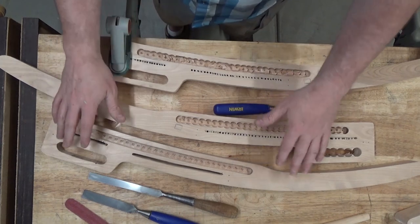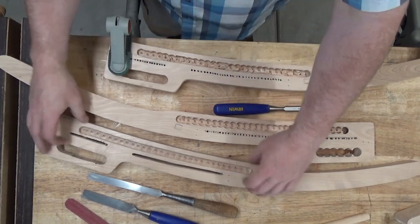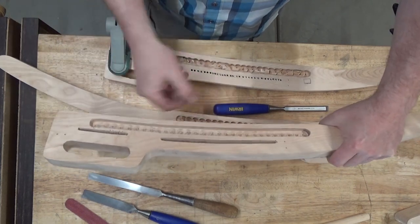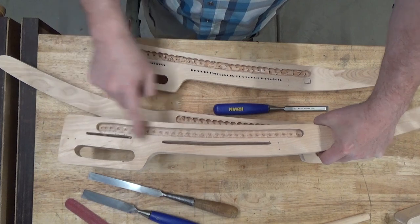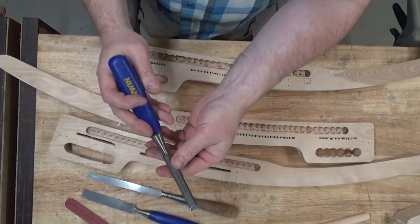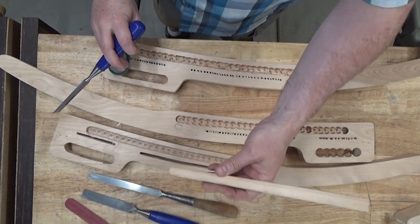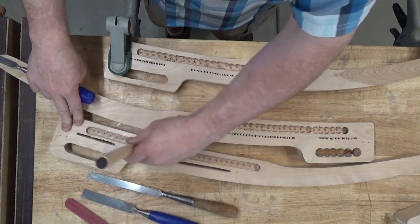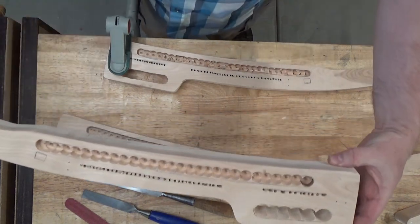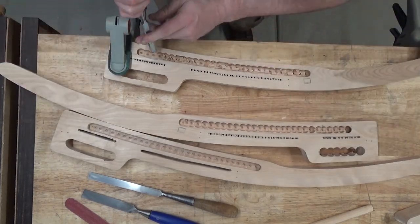I'm really close to getting the project back on track. Here you can see some examples of the work pieces at three different stages. This is that first terrible piece from earlier in the video — actually it's looking a lot better, not too terrible. I have some holes marked here which lay out the mortises for the joinery for the rails. I've used a chisel to pare down the peaks of the Forstner bit holes, and I've made a little dowel which will be the size of the piece that runs in the slot so I can test it and make sure I'm working it down to the right size.